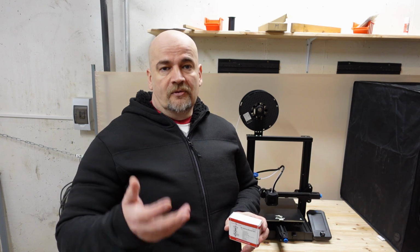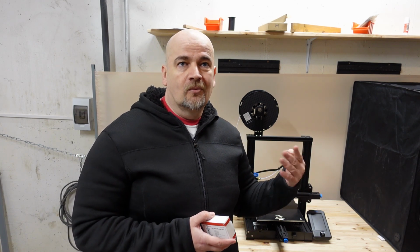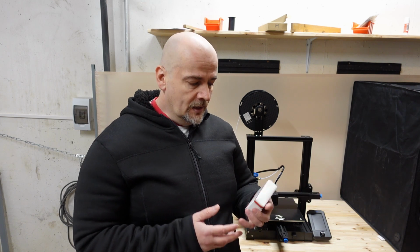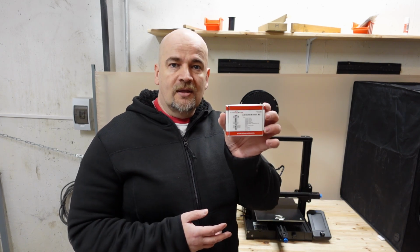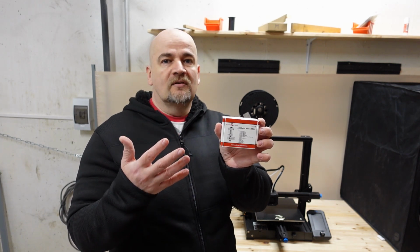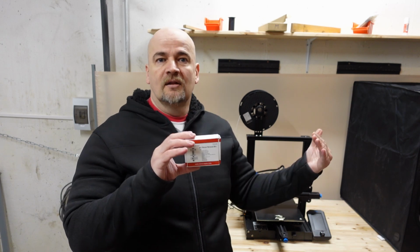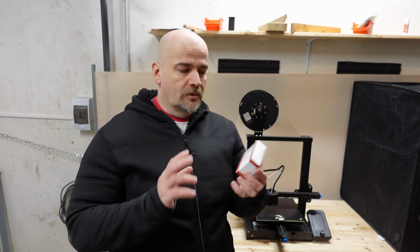Theoretically, if we upgrade the firmware, we could go even above 260 degrees Celsius probably. I'm not sure, it depends on the cartridge and the thermistor, what is their maximum temperature. But with this hotend, we are not limited theoretically to this 260 degrees Celsius, but at least we can use constantly that temperature without any problem.